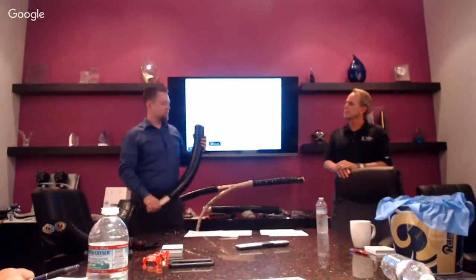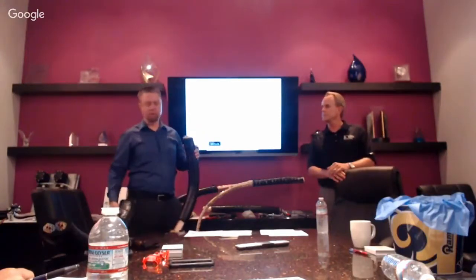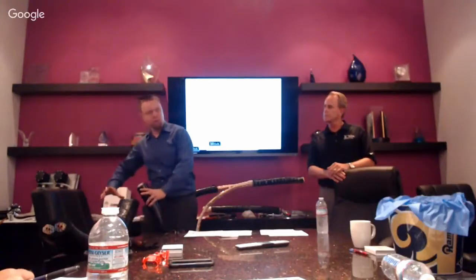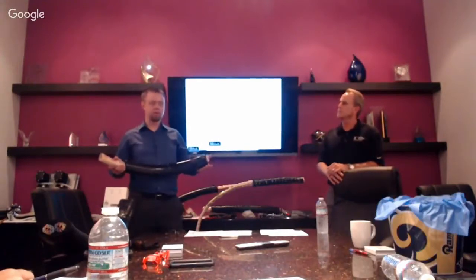So it's hard to say when it's better to have a conduit slightly on the smaller side than what's spec'd, but it is possible for something like this to be so difficult to pull, someone's damaging it just pulling it by hand. If it's going through a pipe that's 10 or 12 inches in diameter, and someone on one end is yanking really hard, you can actually fold the copper over and kink it. Whereas the 12 product may actually be a really good fit for the 6-inch.